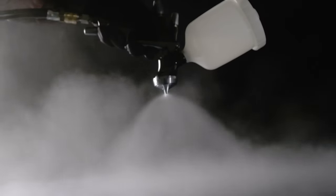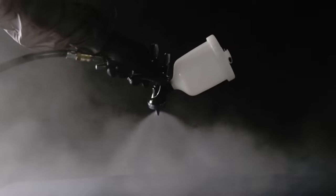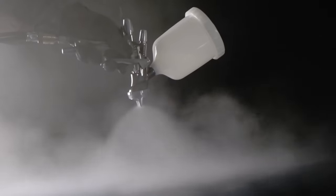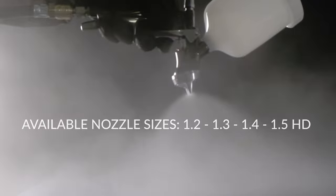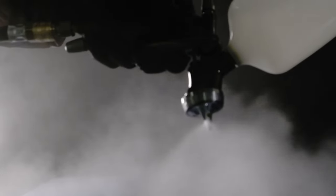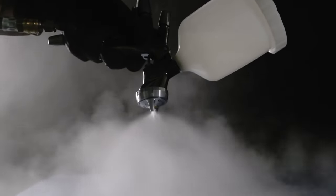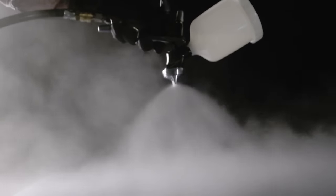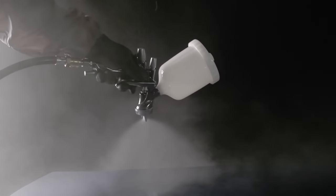With the new development of the Series 2 air cap for clear coats and the ability to develop it separately from the base coat cap, we've also revisited and re-engineered the nozzle range for clear coats. The range still includes the 1.2, 1.3, 1.4, and 1.5, but these have been modified and re-engineered for different climates and conditions around the world, producing wider, fuller, softer patterns at the top but also very consistent flat patterns.